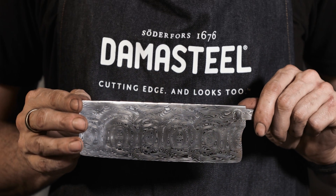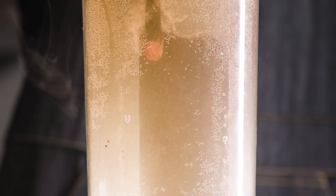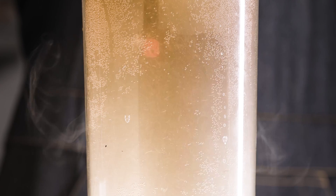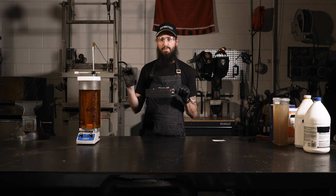We have soaked the knife in the acid — we gave it about a three-minute bath, which really helps pop the pattern out — then soaked it in the baking soda bath, which kills the acid and stops the reaction. At that point we can call it done and this knife is ready to go. Or we can take it one more step: take it to the buffer, give it another acid etch to get a little more bite in there, which reveals more of the pattern and creates more of that topographic design that people really like.